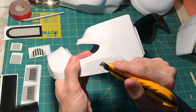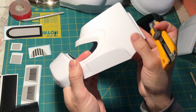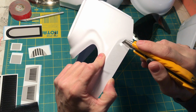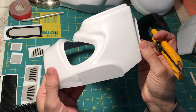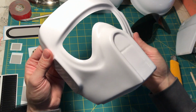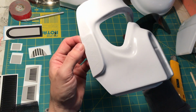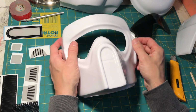But I like to make sure that when the parts are going together, that they can be repositioned without using ABS adhesive. That ABS adhesive is permanent and it dries pretty quickly. So I like to go in with an impermanent method, where you can actually change up that surface as much as you need to, making adjustments. That's why we use the technique that we do to make it.